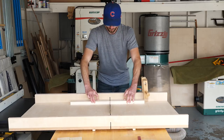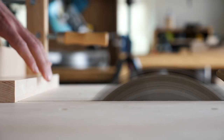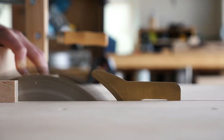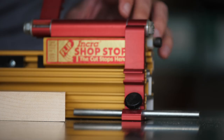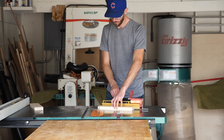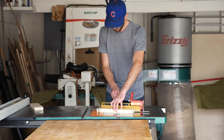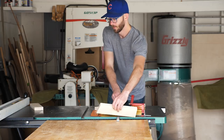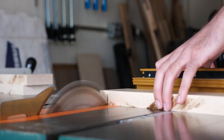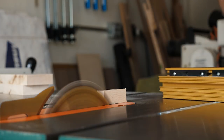Next, I took them back to the cross-cut sled and cut all of what will end up being the horizontal pieces to their finished lengths. For the vertical pieces, I'm going to cut a 15-degree bevel on each of their ends. This will make it so that the legs end up as sort of rectangles that splay out. My original idea was to actually keep the trapezoidal shape of the Nelson bench legs, but splay them out as well. I drew out a few different versions of the idea, but the two angles just weren't really working together that well, so I opted to keep it rectangular instead.